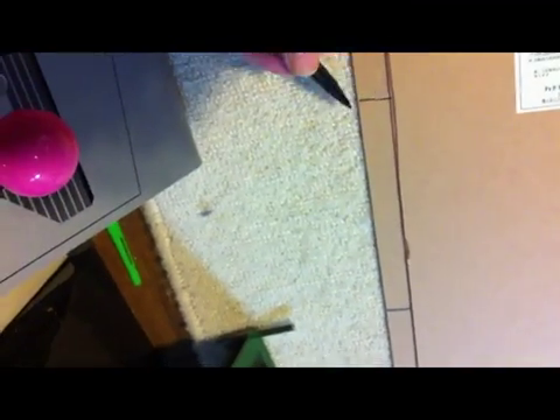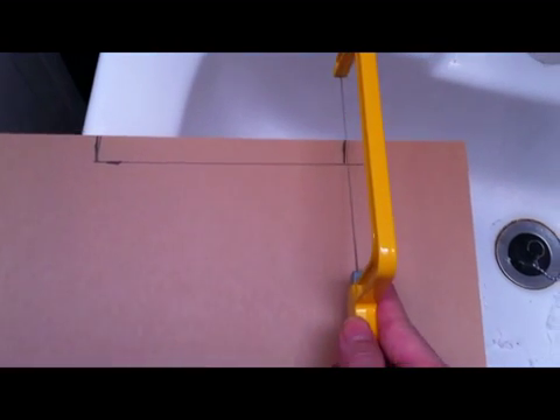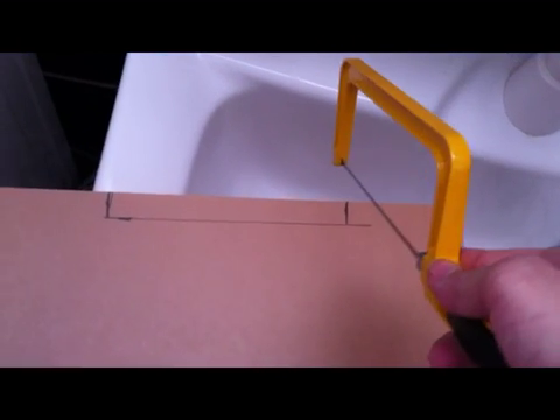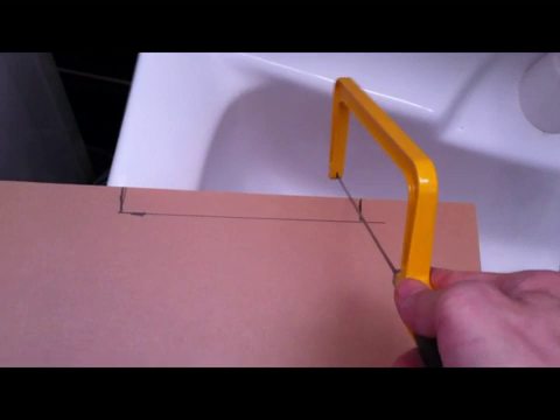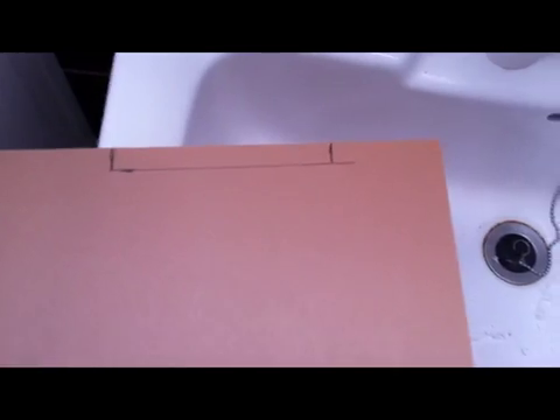I'm always using all the pieces — it's easy. It doesn't have to be super exact, but you cut both sides of the plexiglass casing. For the initial cut I'm using a little saw to make the cut. The short cuts are going to be done with a saw, and then I'm going to use the knife to cut in between those little cuts, and then you can snap it. I made the cut with the saw — it's really easy. Then you take the knife again, take the old plexiglass piece to have a straight line, and make another cut right here, just like that.